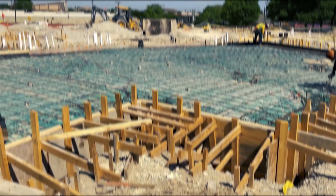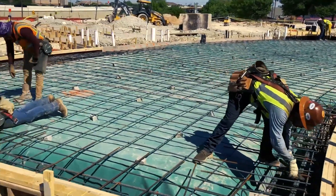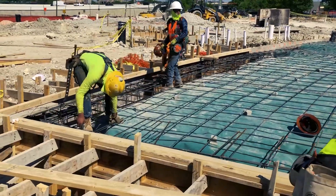The process of rebar starts with submittals. The engineer has designed something, and it's in the contract set of documents that says this is what we're going to build. Making sure that you have produced what the engineer wants so that you install it the way that it's designed. If you start deviating from all the parts and pieces that the engineer wants, then you may be compromising the structural integrity of the building, which is bad.